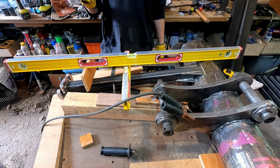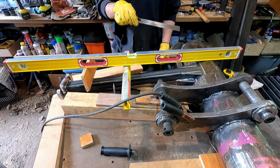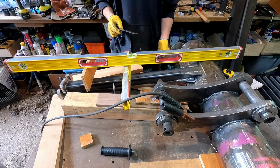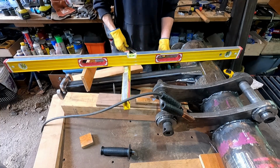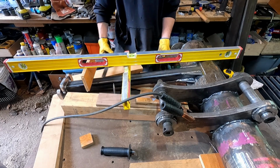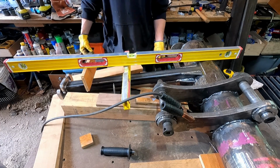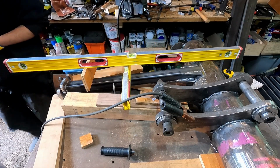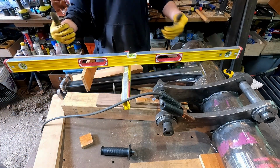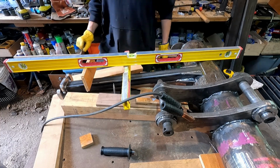and pitched correctly this way using my spacer block. And then to get the last degree of freedom, it's pretty awkward because I use a framing square on the tube here, but these lugs are in the way. So I had to kind of set that like this and take another ruler and measure under to the sidewall here and there. Futz around with it until those came out equal. But all of that's done. And so this lever tube is pitched correctly, is square to the tube wall, is rolled correctly. So it's ready to weld.